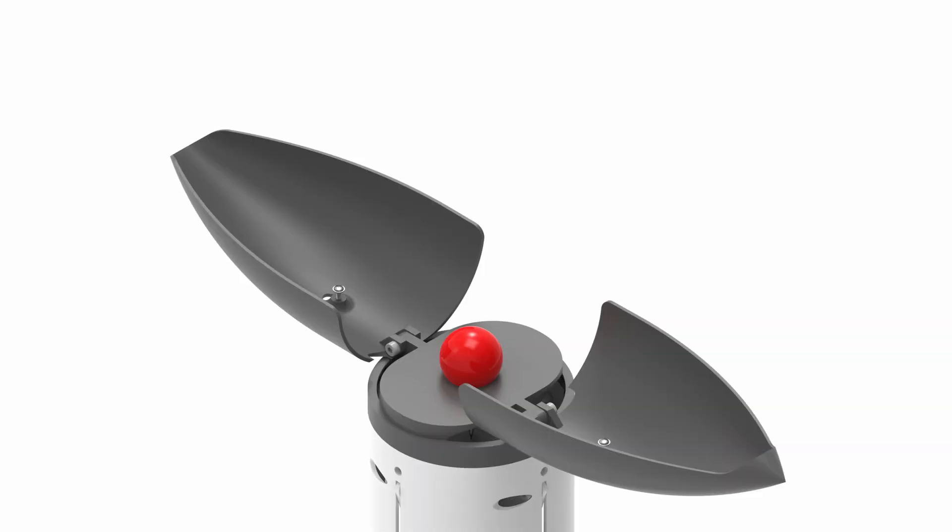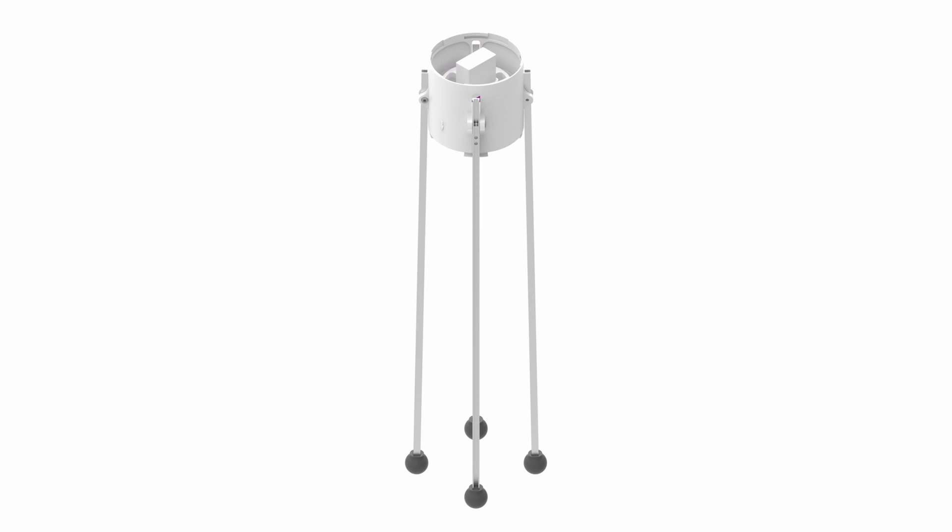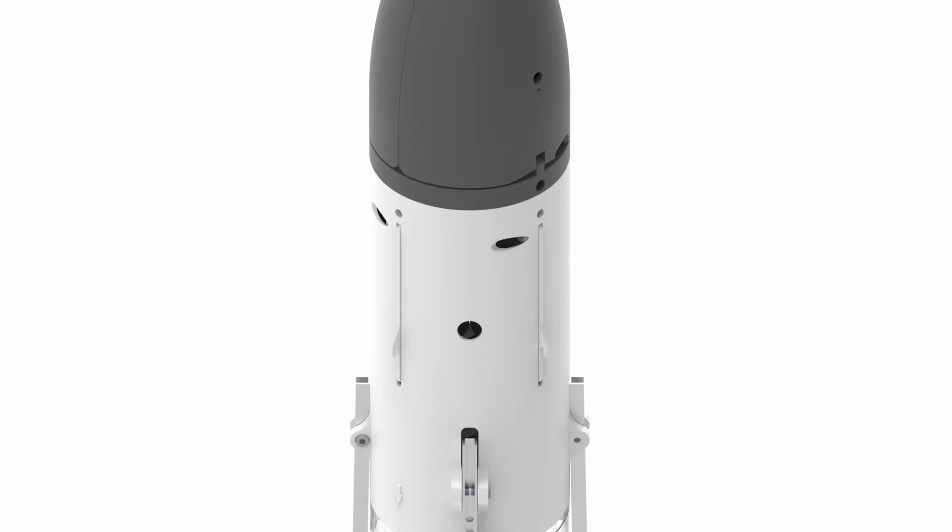For the parachute system, I thought of utilizing the one I came up with for the Buffalo Mini rocket. The landing legs were the parts that needed the most innovation, as all previous designs were too heavy. I thought of simply using four wooden rods that are rotatable around one end. By limiting the rotation through a sloping flat surface and pulling them open with a rubber band, they make up a very simple yet effective landing leg mechanism. One final mechanism I realized I must use are descent fins, which help keep the center of pressure above the center of gravity during descent to keep the rocket stabilized.